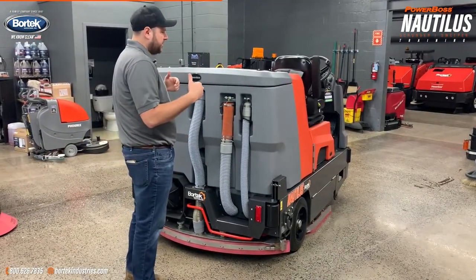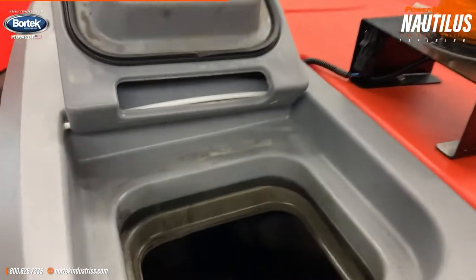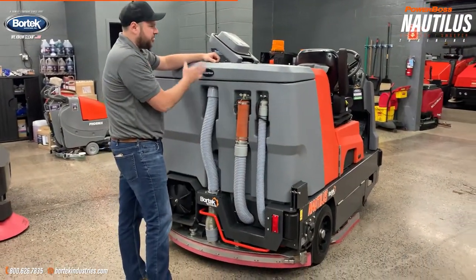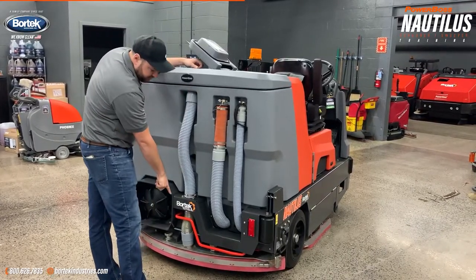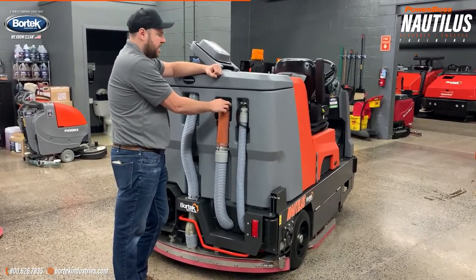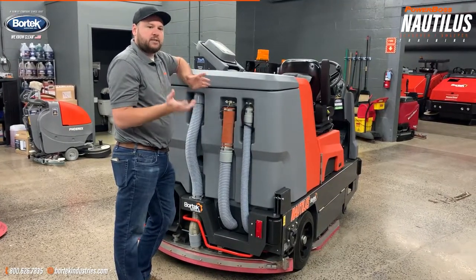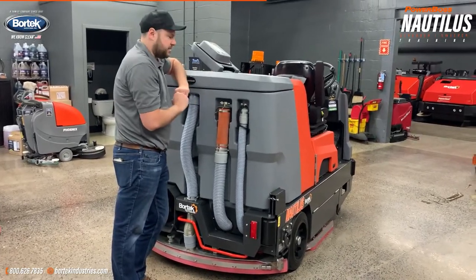After a day of cleaning, the rear tank is now full. We have two access points into the rear tank — one on the right, one on the left — and they go into the same tank, so it doesn't matter which one you open. There are three hoses on the back. This is your vacuum hose, which brings water up from the floor into the dirty water tank. If you get a clog, this pulls off extremely easy and you can also detach it from the rear squeegee. This is your dirty water drain — what we'll be draining out pretty much every day. And this is the clean water drain. You don't need to drain the clean water every day if you don't use the full tank, but I would recommend draining it if it's going to sit for more than two or three weeks, as it does tend to start to smell.